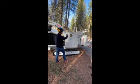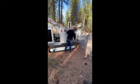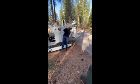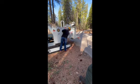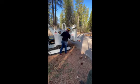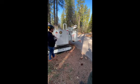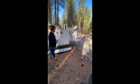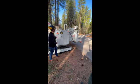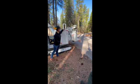Hydraulic tank here, guys. Diesel tank here. Excuse me, before I get ahead of myself. Your 2 daily grease points here. These stickers are indicating you've got one on this bottom feed wheel, one on this top feed wheel. Again, 8 hours, 10 shots of grease. Diesel here, hydraulic oil here. Please know the difference between the tanks. Hydraulic is going to have a little sight glass here. Diesel is going to have a big nice sticker right here. Trying to keep it simple.